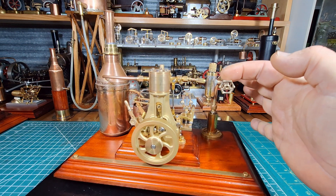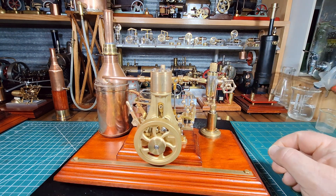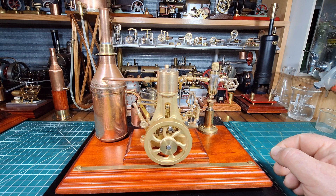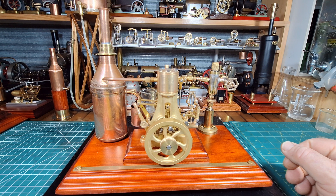I've had a lot of problems with this. All of you with a keen eye will be able to notice there's an unusual looking lubricator. I'm not sure if it's a Stewart lubricator - I'm not 100% sure what the brand is - but I've taken it apart, rebuilt it, and re-brazed it together, so hopefully there won't be any leaks with this.